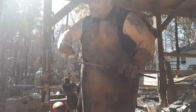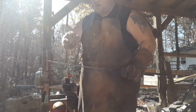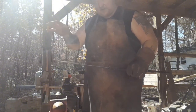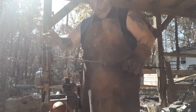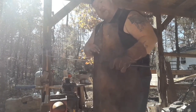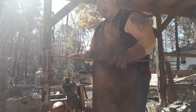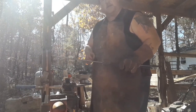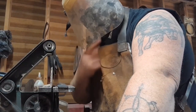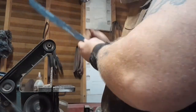We want to measure it against the hand — whatever you do, don't touch it at this point — but make sure it's actually longer than my hand is wide so there's room for a hand guard, butt cap, and the spike. We're going to thread this thing after it's cooled and the spike will thread right onto the back. So we'll anneal it to get all the stress out from being forged, and it'll be ready to go to the grinder. Always remember when grinding: safety first — something to breathe through and protecting your eyes.